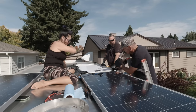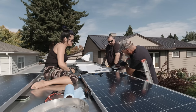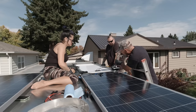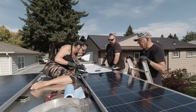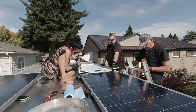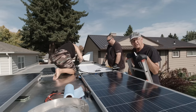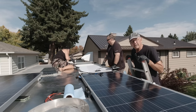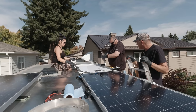Watch how I do this one — especially on the leading edge, I want plenty of adhesive right next to the edge so it squishes out the front. Plenty on the very edge. You want to put it on thick to allow for any unevenness in the roof too — and these roofs are plenty uneven. You can't use too much — well, you could, it's not cheap. Unlike going around your bathtub, this doesn't have to be that neat.